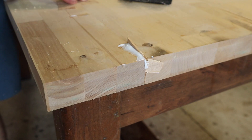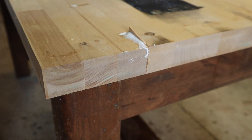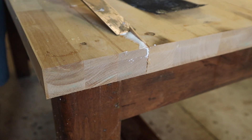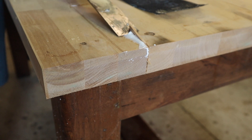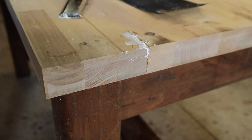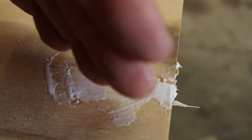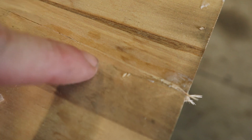Snapping and breaking these off is something I'm used to doing in the field quickly, but I want to express the risk — which I really don't recommend — is that it can force a lot of tear out if you move too quickly. If you don't let the glue set or you try to hammer it off before the glue is set, it ends up looking like this. The grain shears off perpendicular to itself and it just doesn't look good.